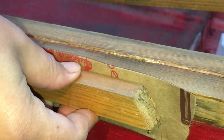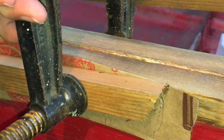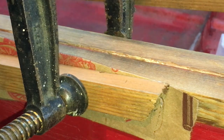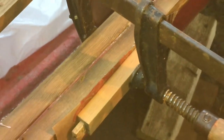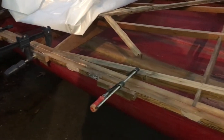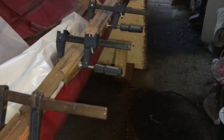I just use a piece of paper and make this clamping apparatus, which essentially pulls all three pieces together — the in-wale, the gunwale, and the fiberglass hull. I would clamp these right where the rivet is, so the top part of the clamp is pushing against the rivet, sandwiching all three together, and that block of wood is forcing the Bondo into the cavern. So it actually works out pretty well. I spent an enormous amount of time, and you can tell by the number of clamps and the patches of Bondo how much was needed. Pretty much every rivet — the wood around the gunwale was just absolutely evaporated. You touched it and it fell off.